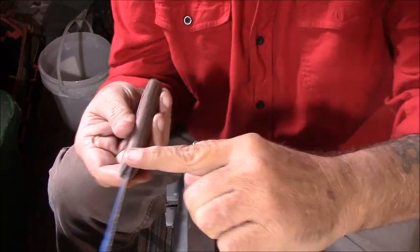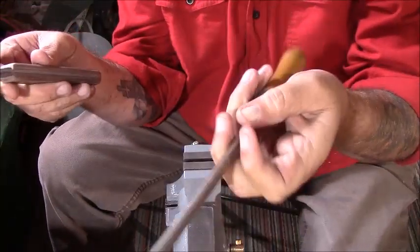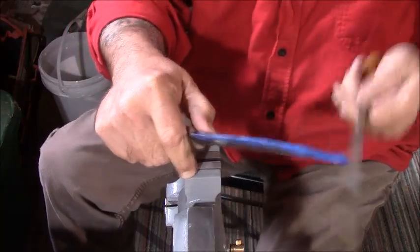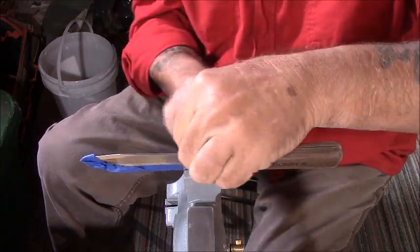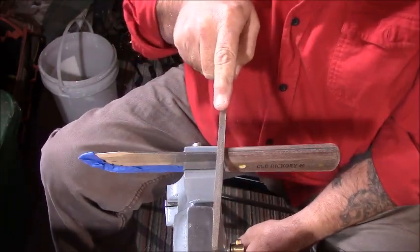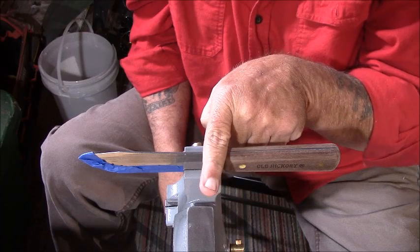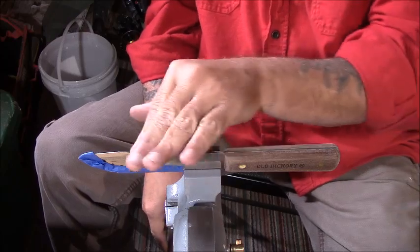They do not have a good 90 on the spine, so I'm going to show you how I do it. Pretend this is a ferro rod — when I'm striking it I'm going to hold the knife still, tilt it, and draw the ferro rod across it. I want my best edge for scraping on this side. I'll put it in the vise. I'm only going to file in one direction so that if there's a burr it faces the right way — just like a scraper going across the ferro rod. This only takes a couple of strokes.